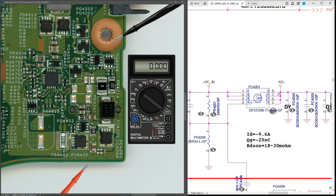If our P-channel MOSFET is switched on, that should mean 19.5 volts is making it from our source pins through to our drain pins. We need to measure the drain pins and confirm. There are two sets of two pins but they're all joined together, so any measurement is representative of all four drain pins. Measuring at the drain pins in volts DC, we measure 19.5 volts — so our MOSFET is turned on and 19.5 volts is making it through the first MOSFET.